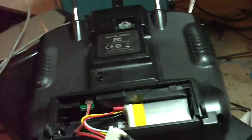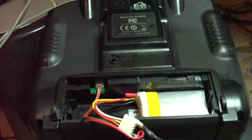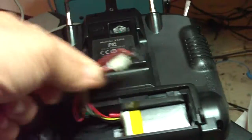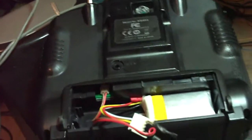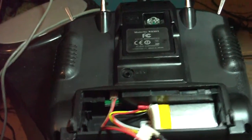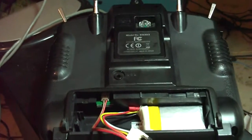I've got a little 500mAh cell in there right now, just what I had laying around, and I'll get about three hours out of that. Since I'm going in through the balance port, I can put any size LiPo I can find in there. My larger packs used for my 450 are too big to fit in the back of the transmitter, so I work with what I've got.